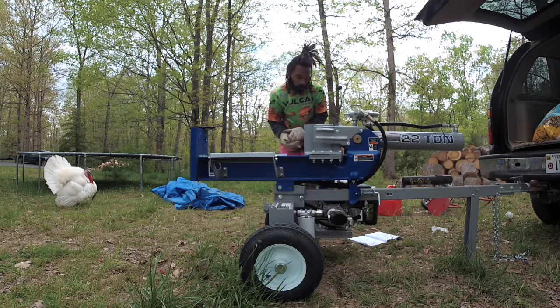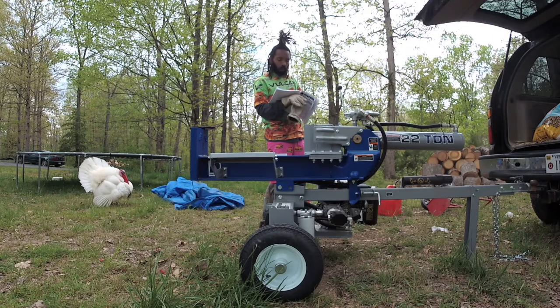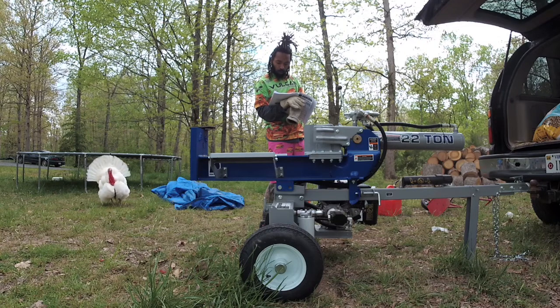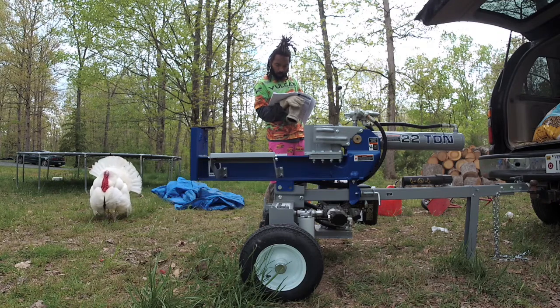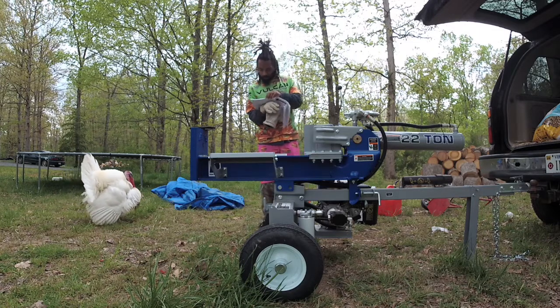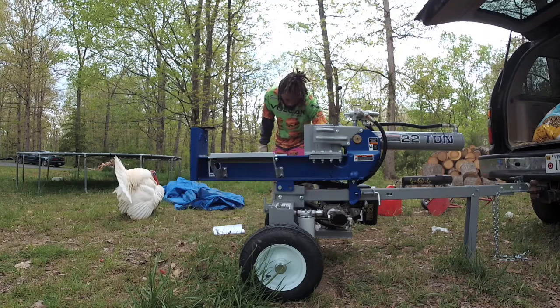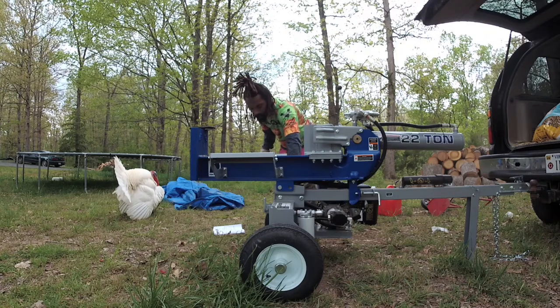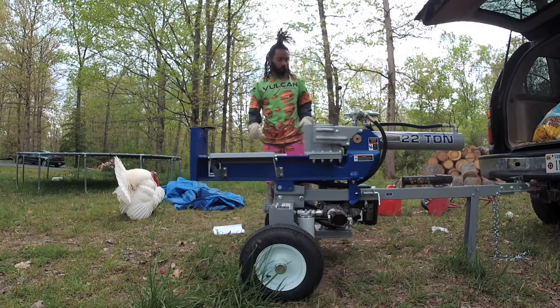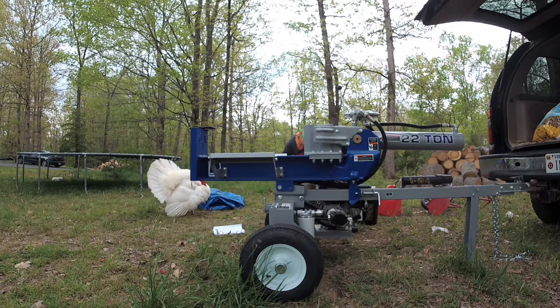All right, and our hydraulic fluid levels look good. Replace hydraulic oil fill cap vent. Run it again. That's tight. Tighten this all the way down, and be sure to wipe up any excess too. Turn the kill switch back on. Gas is on.